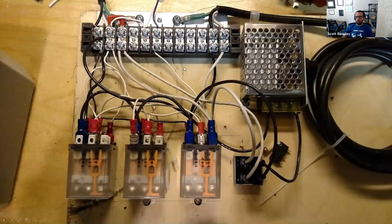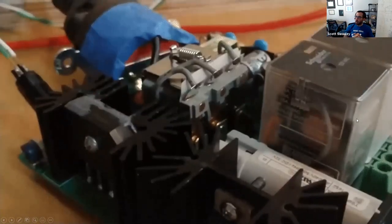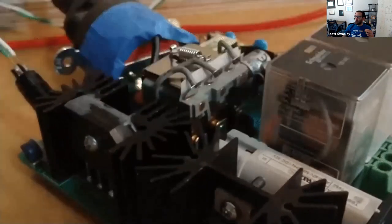Here's an example of one of my first prototypes — three pole double throw relays. I was actually able to implement most of my technology with just relays, except for one special case. Here's a slow-motion video of it operating: a relay trying to open at the wrong time, and you see a flash. Someone in the last session asked why relays arc and wear out. The answer is almost always that they weren't used for their rated purpose.